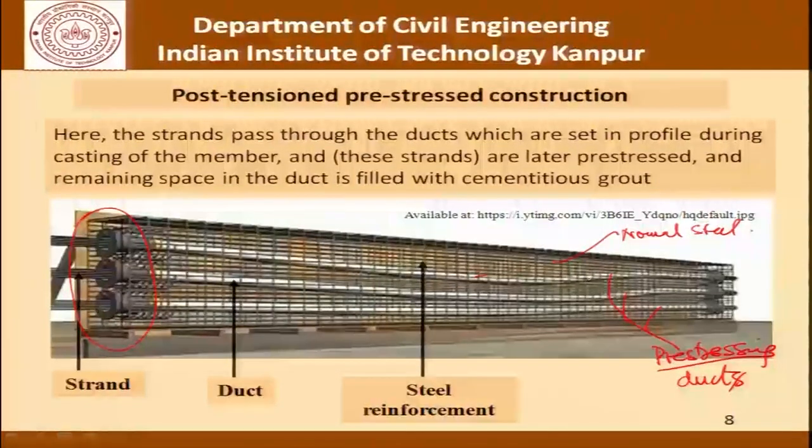The profiling of ducts is a matter of pre-stressed concrete design and we are not getting into that. But we must understand that these are not straight, and if they are not straight that raises certain issues as far as quality control is concerned. We place these ducts inside the reinforcement cage, cast the concrete around it, then put the strands or tendons into the duct. After the concrete has hardened, these tendons are stretched or tensioned and finally let go, causing the concrete beam to undergo compression. This is what we call post-tension pre-stressing.